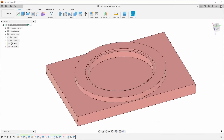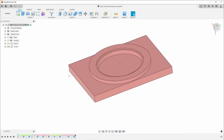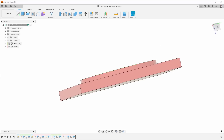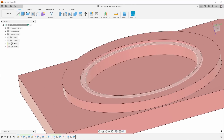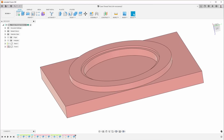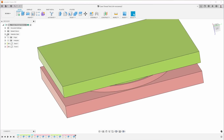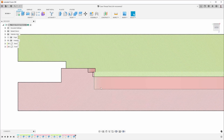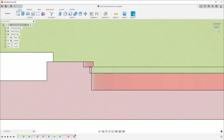I'm going to figure out the right dimensions for the O-ring, make these test parts, and then test them to depth. This is the CAD file for the test specimens from the previous video where I milled the threads. You can see the two parts here, and I modified it by adding this area which effectively becomes the slot for the gland. If I turn this on and look at the cross-section, you can see that we have effectively a slot for the gland.